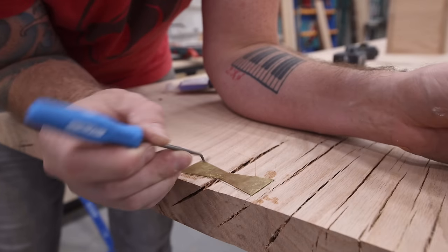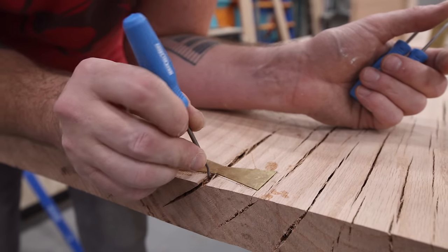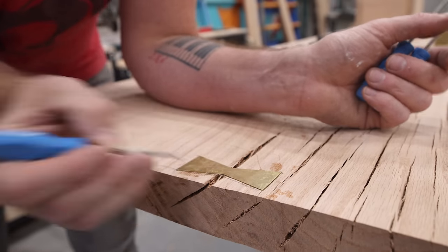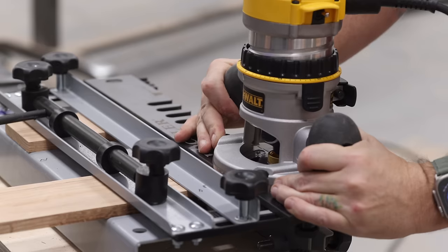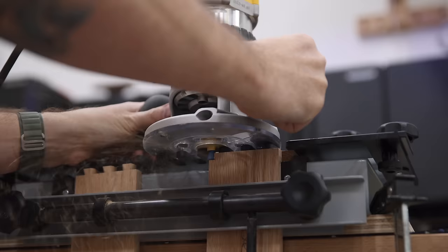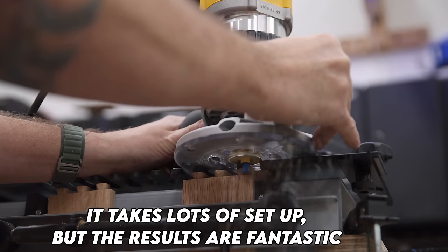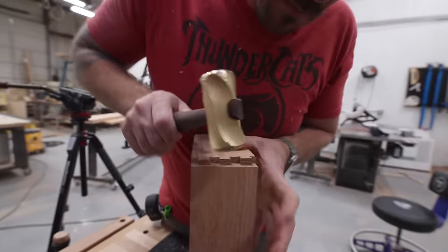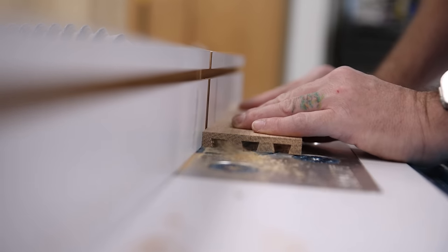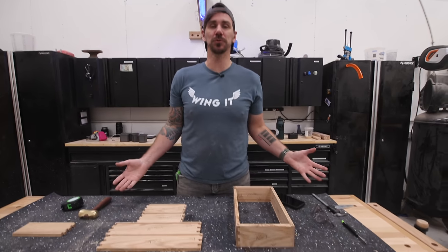This little pick set I'm using is super handy for cleaning up excess epoxy — I'll link them down below. These are pretty inexpensive and I find myself using them all the time for a bunch of different things. Moving on to making the drawers — I decided to up the ante and try half-blind dovetail drawers using this Rockler dovetail jig. I've never done this before, but these drawers came out super nice. The dovetails weren't entirely necessary, but I really think it adds an extra touch to the overall fit and finish of this bed. Took me two days, but I have two drawers.